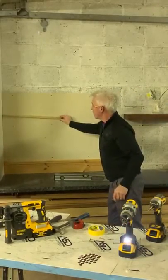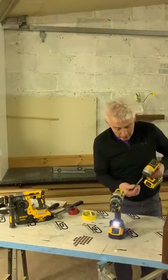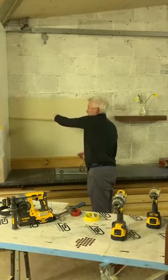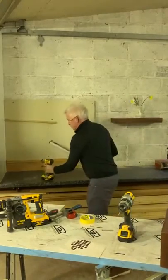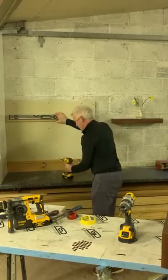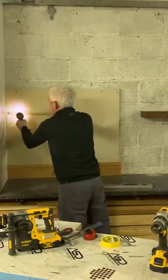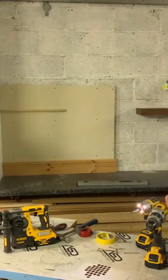Now you can see I have the plasterboard marked for the hollow wall fixing. This fitting is geared to take a standard screwdriver tip, and it's actually not a bad idea to put it in by hand — you can see it goes in lovely. You want to tighten it with the hand screwdriver rather than over-tighten it with a power drill. Put the baton back up, level it — it's nicely level — and that should be in the same position. It's as strong at that end because I didn't over-tighten the plasterboard fixing, meaning it gets full value from its strength.